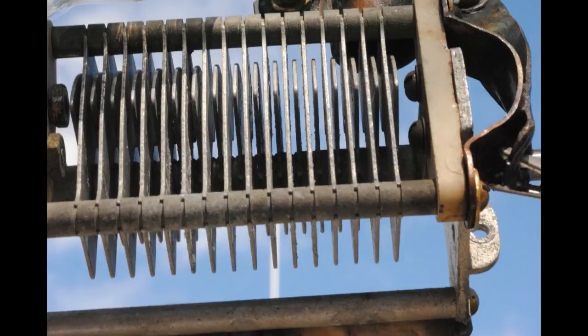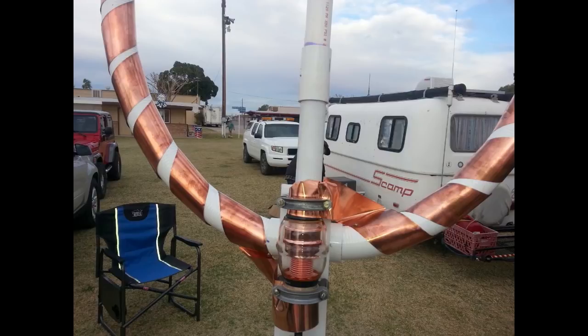It looks pretty close for more than a few 20 or 30 watts on this one. Well, these are actually two 200 picofarad, 2,000 volt capacitors. And when you hook them in series and just take the connections from both ends, then it becomes 100 picofarads and 4,000 volts. Wow. So likely we could run maybe 50 or 60 watts? Well, I did okay with 100 on 40 meters. But it calculates to very close to 4,000 volts. Wow. Well, that's terrific. And of course, we encourage all of you to think about making up your own.